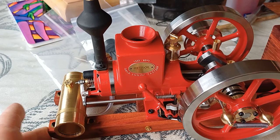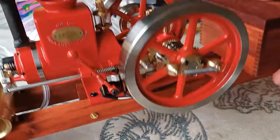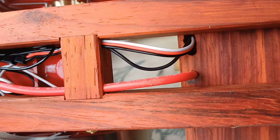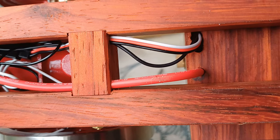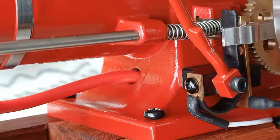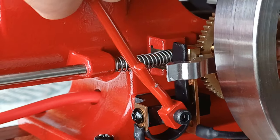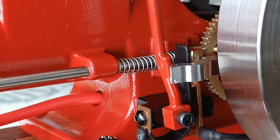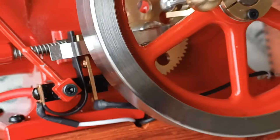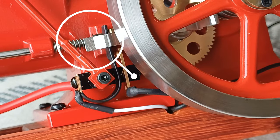G'day g'day. We're back again and I hope you had a good sleep, internet. I certainly did. It's the next day and I've finished my Musa HM01 build. I'll show you the underneath for how I've laid out wires. So we've got the ignition timing wires — the three at the top, the middle one is the earth, and the lower one is the high tension to the spark plug which comes out down there. This lever goes under there to stop the detent going in and doing the hit and missing. So that's going to be full — that's going to be the normal hit and miss operation. This is going to be full operation. I can get this exactly on the side. Mine is slightly on a down angle and I need to just get that up a couple of millimeters. I want the middle of this to line up with the middle of that.